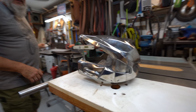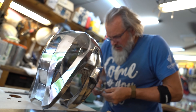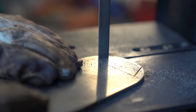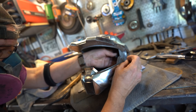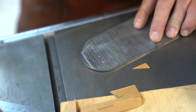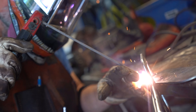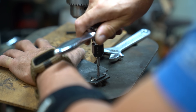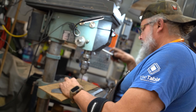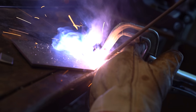It's finally time to put a visor in this helmet. For this next part, I'm here with my father. The goal is to figure out a way to attach this visor into this helmet in an extremely secure way — after all, we're going to be shooting this helmet with bullets. So first, we're going to make some brackets out of stainless steel plates, weld them to the inside of this helmet, and then bolt this visor on. We cut the flat shape of the bracket out of a thin piece of 316 stainless steel. We needed to drill and tap some holes so we could run a bolt through each bracket and clamp the visor in place. But the bracket was so thin it didn't allow enough threads, so we welded another piece on top, drilled a hole through both pieces, and attempted to tap it. This definitely isn't my dad breaking a tap in one of those brackets — he's definitely going to kill me for keeping that in. After he re-drilled the hole and re-tapped it, we moved on to the two remaining side brackets, until we had three brackets ready.